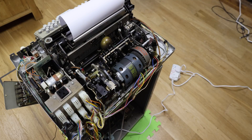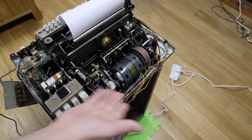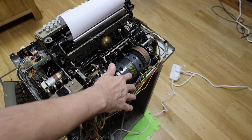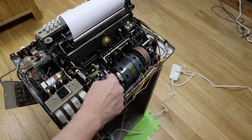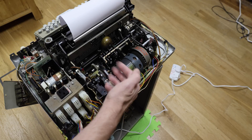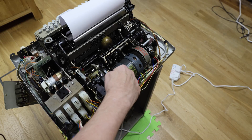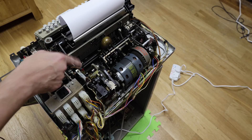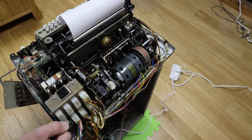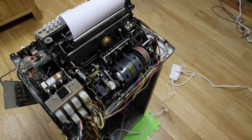The motor is the key workhorse for the entire system. It runs off the main power supply and runs continuously. This is a 50 hertz version which does ten revolutions a second. It has some gearing and one of these trippable clutches. The mechanical linkage from the keyboard trips this clutch causing it to engage, and as it goes round there are cams at the back which cause it to disengage at the end of that one cycle — sending one byte. There's also a trippable clutch the other side, and this is where we come into receiving data.